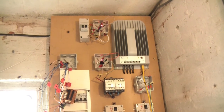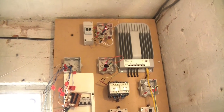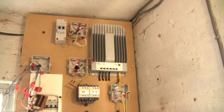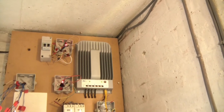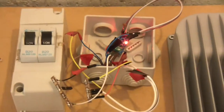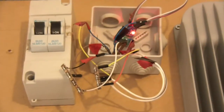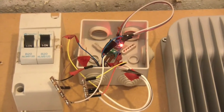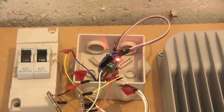With solar, you could measure the solar input voltage, the solar input amperage which goes to the charge controller, and then from there the current goes to the batteries. You can monitor the battery voltage and the current going to the batteries to charge them. Up here you can actually see a voltage divider that I use as a sensor to read into the Arduino how much voltage is coming in to the system through PV.